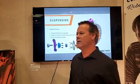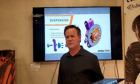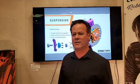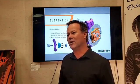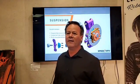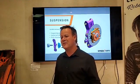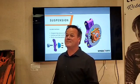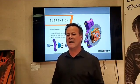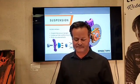Okay, so you go to Mud Nationals and you submarine this thing and you decide, oh, you know what, I'm just going to go ride next week. But you forget to clean your wheel bearings, you forget to do all the stuff because sometimes you're going to have seepage. When you get water in the bearings, they're going to rust, and when you get rust in the bearings, they're probably going to fail. This comes down to the user of the vehicle doing things that we highly suggest not to do, but it is the off-road industry and everybody's out there thrashing and having a good time.